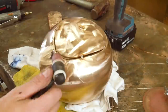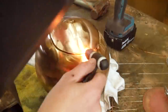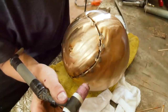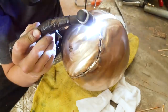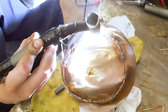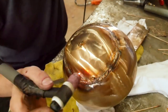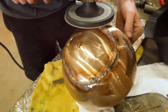The heat of welding warps and moves metal way more than you'd ever expect, causing ripples and warping. I add a bunch of small tacks to aid in the structure of the metal for the future when I decide to weld the entire seam line continuously. Once the tacking is complete, I'm ready to weld the full seam. One important but counterintuitive aspect is that all of these welds get sanded off immediately afterwards and get sanded flush. It's important that I don't have any pitting and that all of my welds are positive or convex — without any holes, gaps, pits, or undercuts — because this will show blatantly in the smoothness of the surface of the balloon.